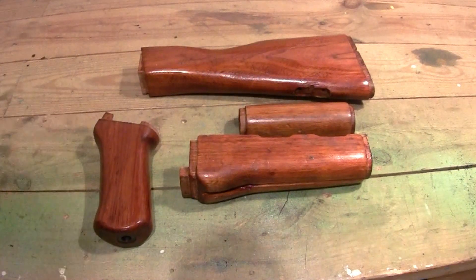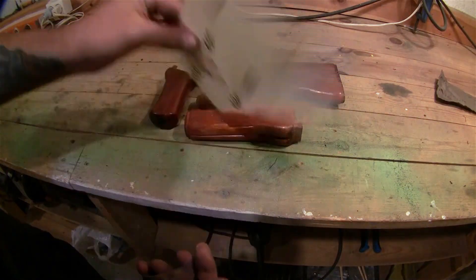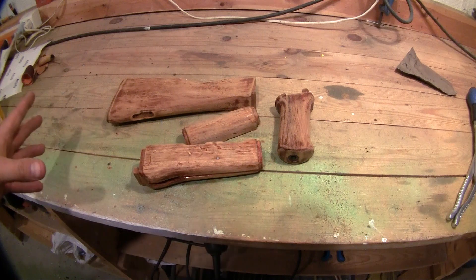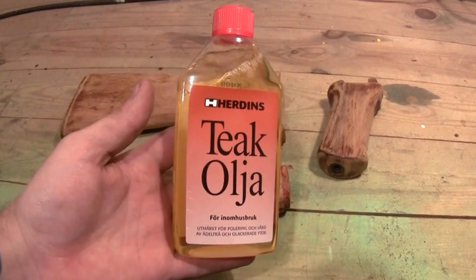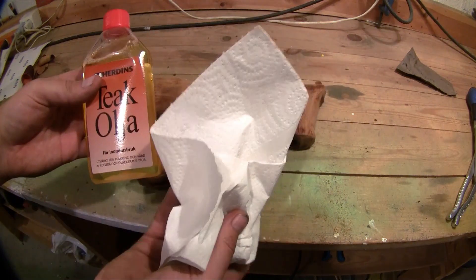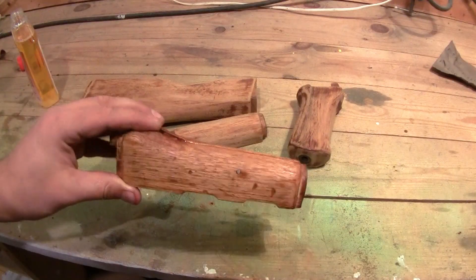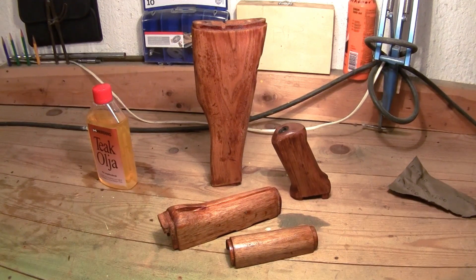As we wait for the Coca-Cola to set in, I'm going to remove the finish from the wood parts. I'll start with some lower grit and then continue with 400 grit. Here it is after I removed the finish. As you can see, it's not perfect, but that's how I want it — so it looks like it has been worn in a battlefield and then refinished with some of the original finish left. What I'm going to use is teak oil — probably the same name in English or just some kind of furniture oil. I'm going to apply it with some paper, but be careful with the paper after you're done — put it in water because it may start a fire. I'm going to let it dry and soak into the wood, then it's time for the next step.